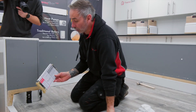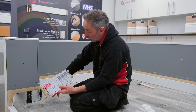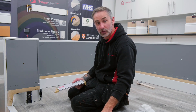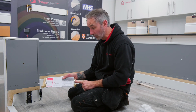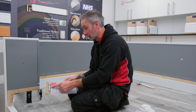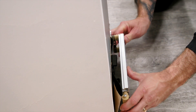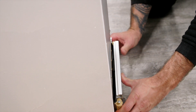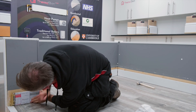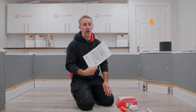The last piece has been built up with the return manifold. As per the instructions and as we've seen on the external corner, the spectacle clip should be on the front — and this is also the case for the return manifold. We're now going to push this last piece of skirting, align the o-rings up with the fitting and the aluminium, give it a push, clip on the bottom, clip on the top.